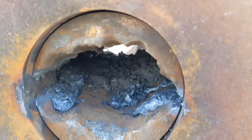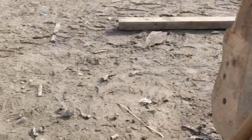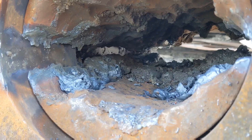Had to use a straight cutting torch. It's a very useful piece of equipment, lets you work straight on down into a hole where a right angle 90 degree head wouldn't easily allow you to work in, and cut the last bit out.